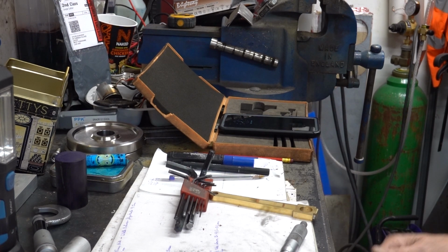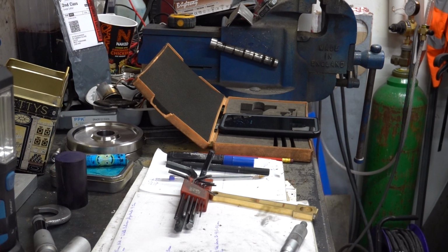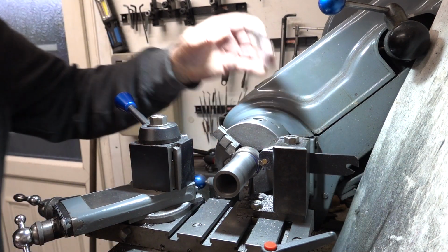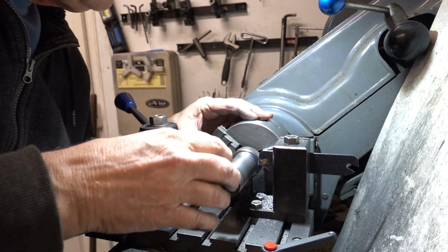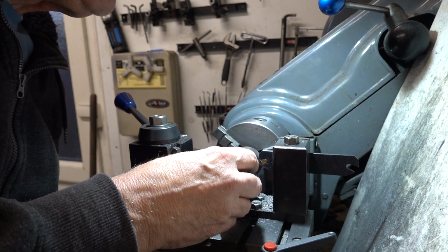So it needs parting off, which is 3.28, which is what I measured, 3.28 millimeters. So if I part it off at just past 4, then I can face it, can't I? What do you think? 4.5? Let's go 4.5 mil from shoulder. Stop it light. Oh God, need to get one of them ordered. Remind me tonight, order one.